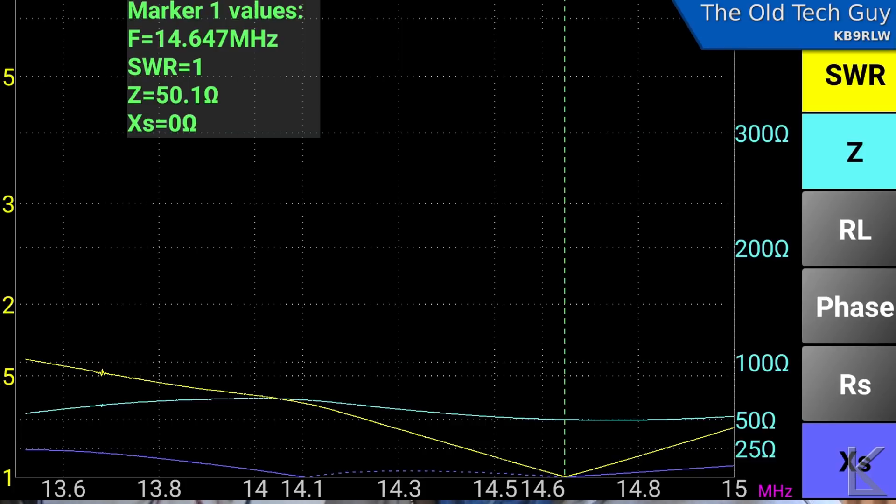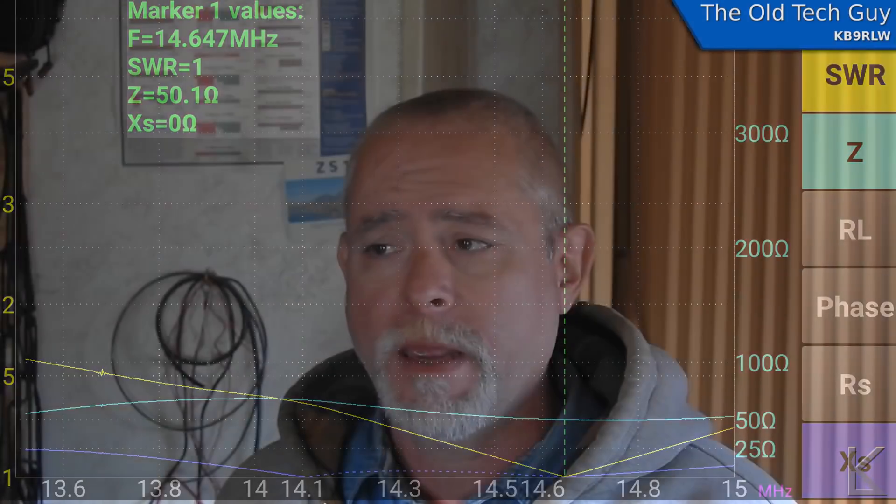The tuning did shift when I raised the antenna up and raised the feed point off the ground. The resonant point moved up in frequency, so the antenna acts like it's shorter than it needs to be. I had to add about three inches to the antenna to bring it back down into the middle of the 20 meter band. So raising that feed point up off the ground definitely affects the tuning, and you'll have to re-prune the antenna depending on your installation.